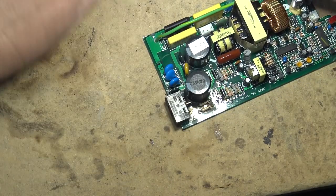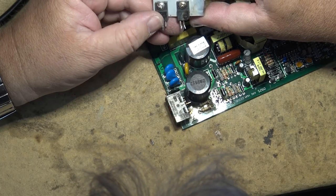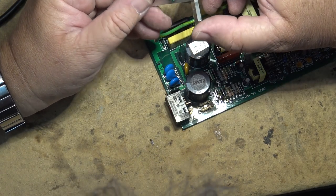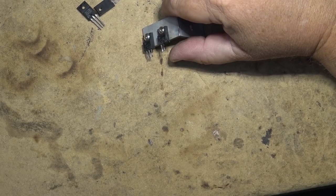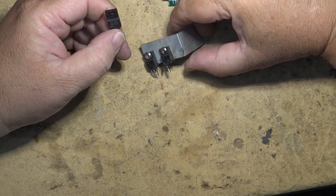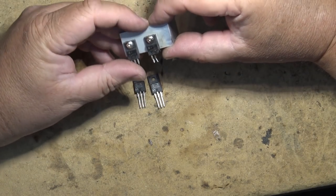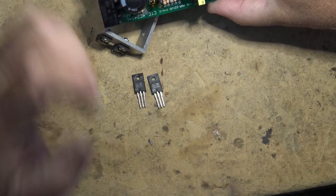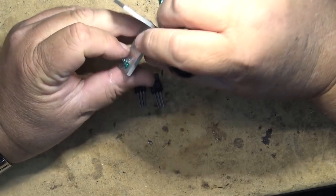Now I've got to find out what these MOSFETs are. Oh — are these 2SC4977? They might even just be regular transistors. So this uses 2SC4977, which I don't have anything close to. The closest I've got is some 2SC4130s, which are old from the VCR days — I've got a whole bunch of these from when I rebuilt power supplies in VCRs. I think they're probably as close as I'm going to find. I'm going to try them. What have I got to lose? The worst thing that's going to happen is they're going to go boom.